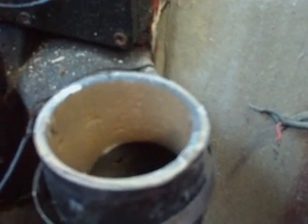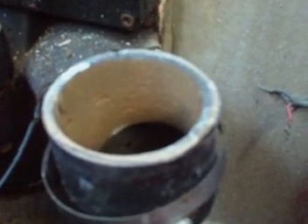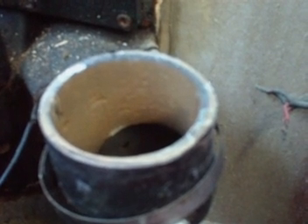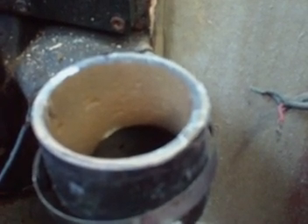What I don't like about this setup is on a boat like this — it's permanently moored — the danger is that one day that aluminum will corrode away, and you'll finish up with your boat on the bottom.